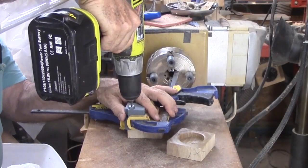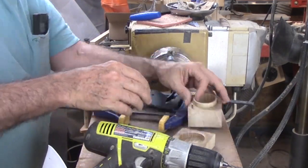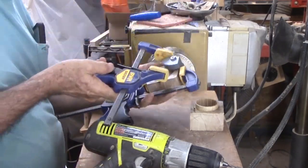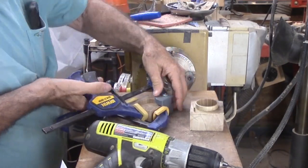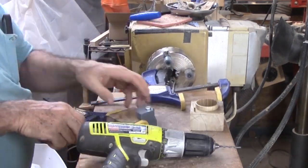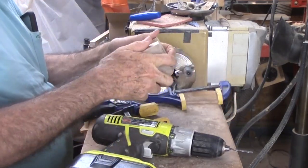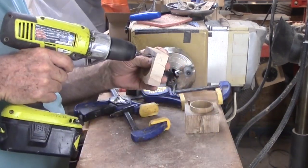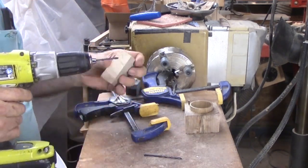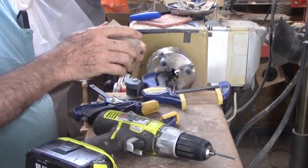Since there is now no way for grain to match and the sides will potentially not line up anyway, any slight deviation will show up significantly. I am drilling for a ⅛-inch brass rod piece. To ensure it lines up, I made a jig by drilling out a short bolt and threading it into a 3D printed corner jig. This jig could also have been made from wood and glued into a corner. After drilling the base and the lid with a ⅛-inch bit, I drill again one size up for the lid hole only. Marking the corner prevents mixing things up as the pieces are rotated.